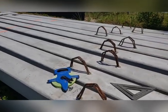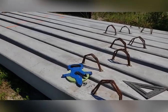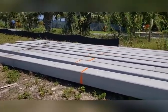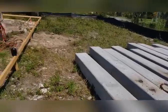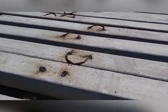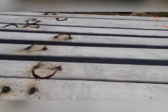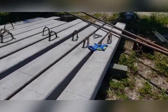Components of a concrete piling include these loops that are sticking out of the side of the concrete. These are set when they pour the piling at the factory, and they're used so that we can actually lift them up into the air off of the haul trucks and set them on site. We've taken an acetylene torch and cut these loops off of each of the piles. What we'll do later is come in and apply a non-shrink grout to cover up the holes. But if you get concrete piling, you're going to have to deal with some of these loops sticking out.